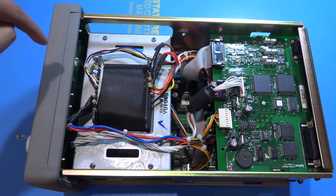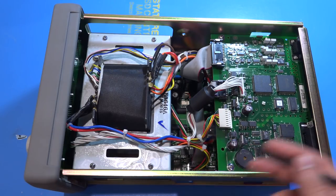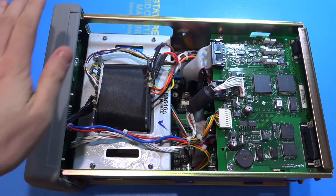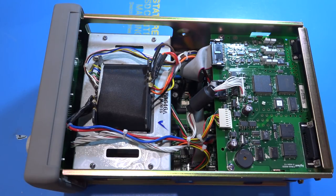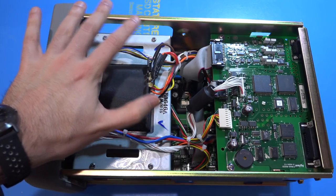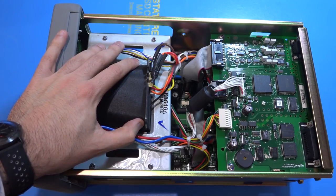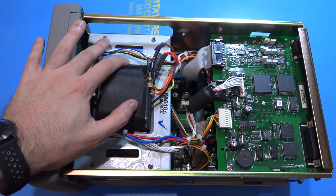The digital board also controls the front panel VFD via a serial interface. These VFDs have their own little processor, so if you don't have a screen it may not mean the main processor is bad - it could just be the front panel processor. Everything looks normal inside, so we'll have to dedicate some time to figure out what's going on. In principle, we should be able to understand how it works at an abstract level.